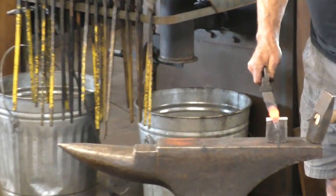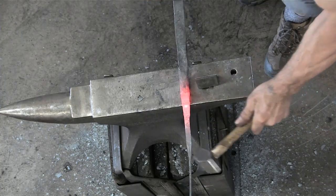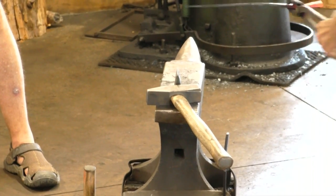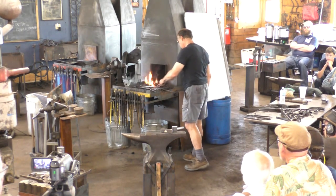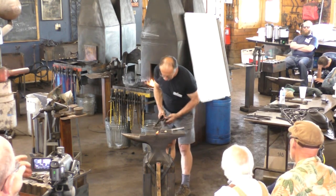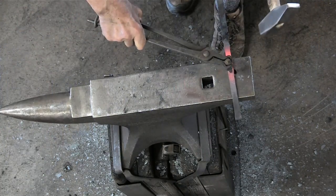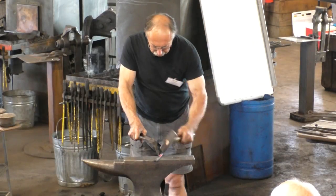All right, 2 1/4 plus, we're going to want a hunk. This is pretty good iron, the stuff that I brought with me. See, it takes 3 or 4 bends to break off. The worse the iron, the fewer number of cycles before it breaks. A lot of that Globe Ironworks iron is hot short, and it will break on the first bend. What name of iron is that? There's a lot of iron being sold from the Globe grain elevators in Wisconsin.